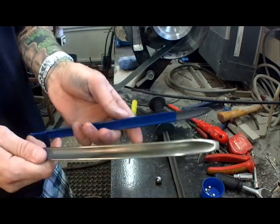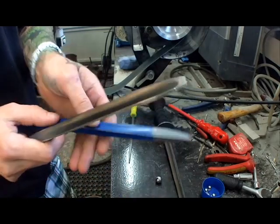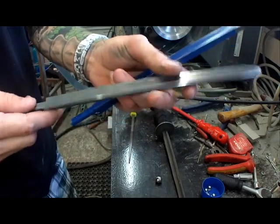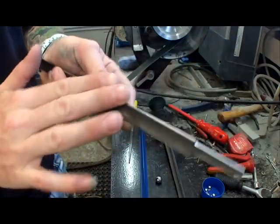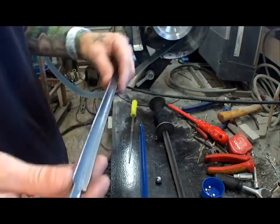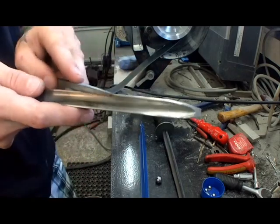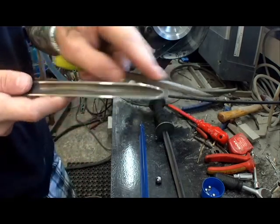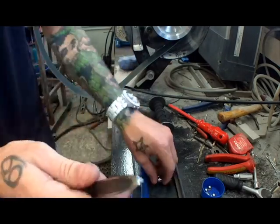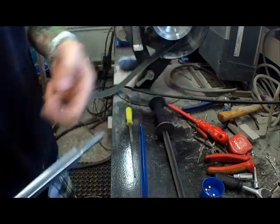What I did to this, as I said, I heated up the tip to get it weak, but not just that, also to remove the color. The color rest I removed with a paint remover. The corners I rounded off on my belt sander, so you could make it with common tools too. As the steel is weak, you can use a normal file for filing this up to the tip, no problem when you weaken it. But you need a welder to weld on the tip, the ball bearing, for safe sparring.